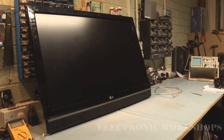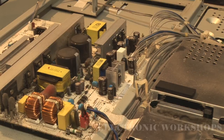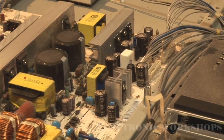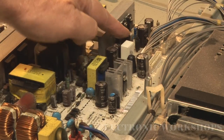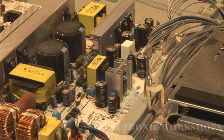What I'm going to do now is take it back off and have a look at the power supply and do a visual inspection. I've done a visual inspection and what I suspected was bulging capacitors, and what we have here — as we can see on this corner of the board — we have one, two, three, four, five, six bulging capacitors on the secondary side of the power supply.